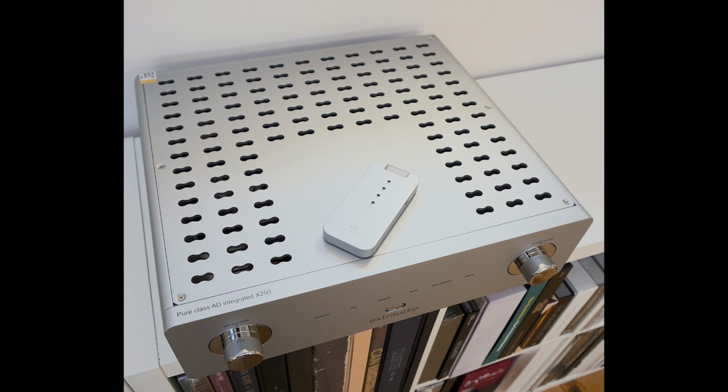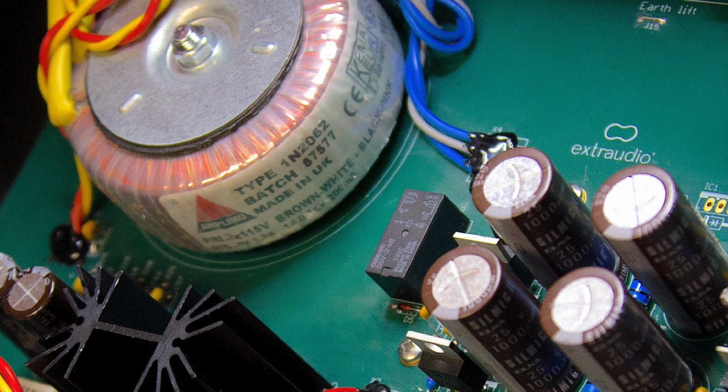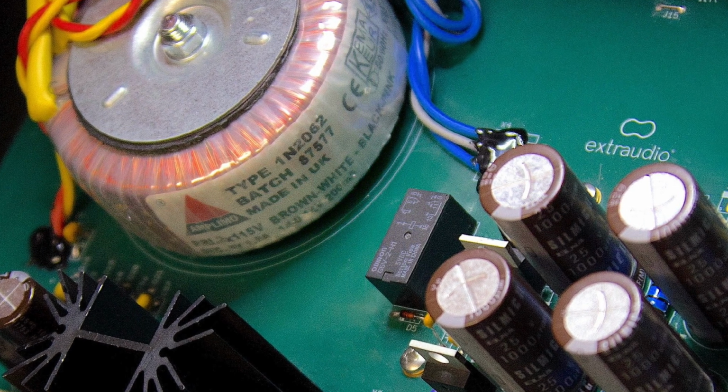It includes the company's own XP1 preamp inside, and also inside is a dual mono design. It uses a modified N-Core Class D power amplifier from Hypex, but this, I repeat, is a modified version. It is not an off-the-shelf model. The company says that it has injected Class A sonic elements into the design, which is why it describes the sound of the X250 as Class AD.